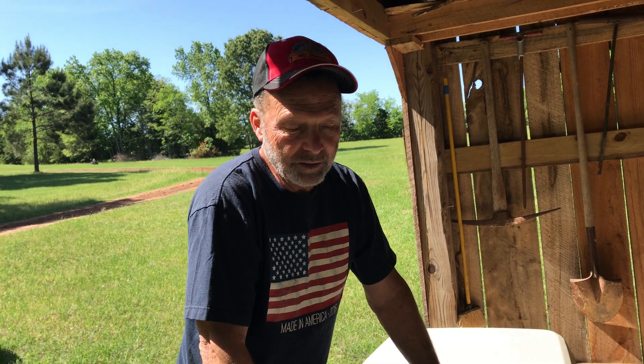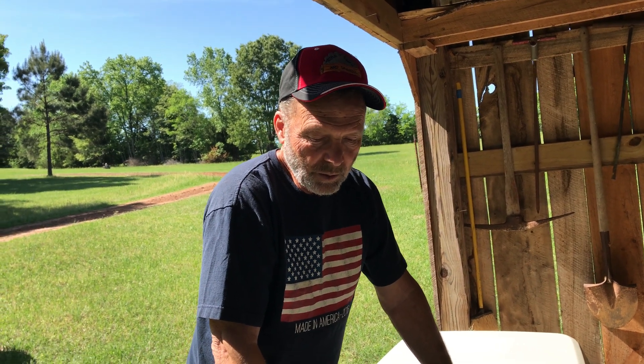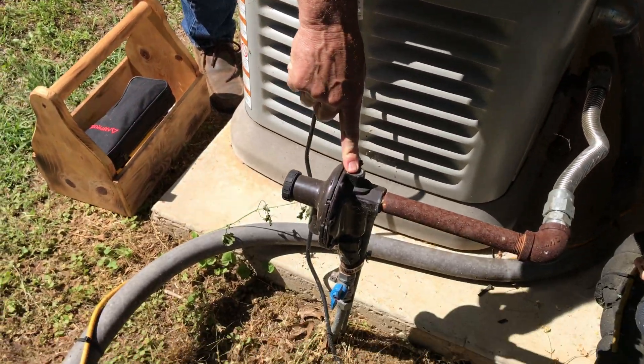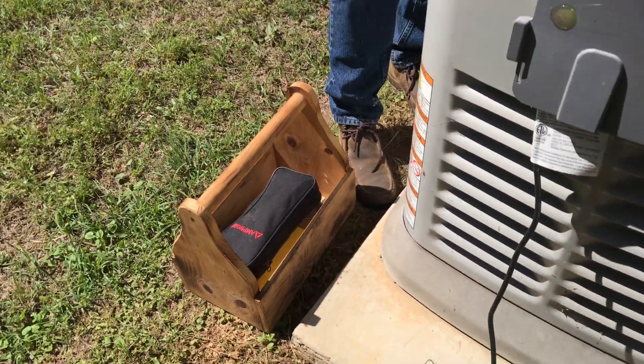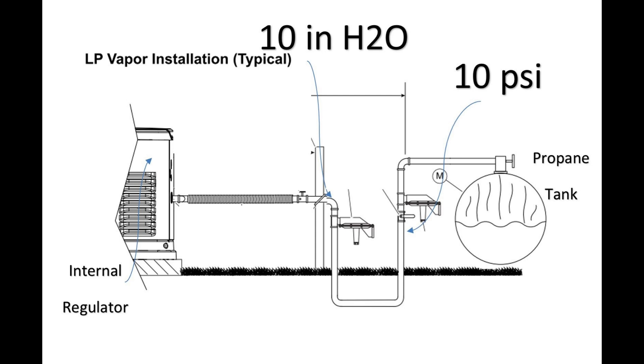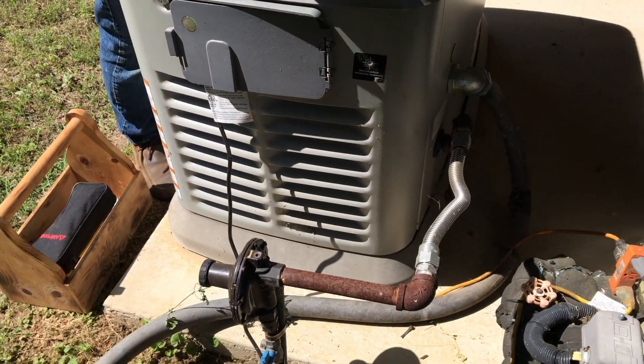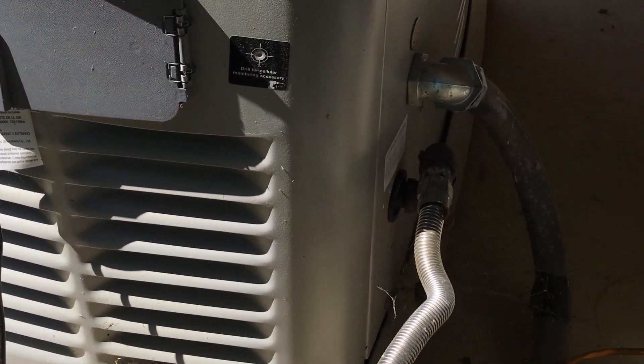It will never get to a steady state and it almost sounds like it's gonna die. So I'm gonna put my gauge in. I got a gauge for this and a gauge over on the propane tank, and we'll see if the regulators are not supplying enough gas, or if these are not oscillating, then it's probably gonna be that internal regulator again.